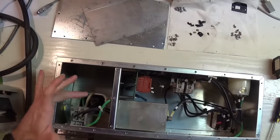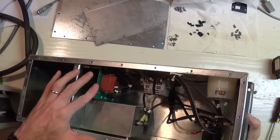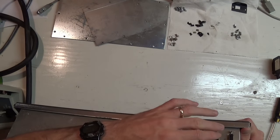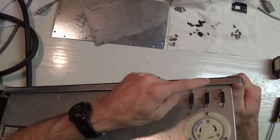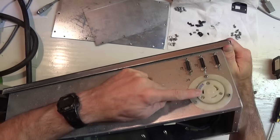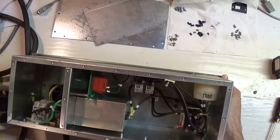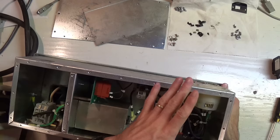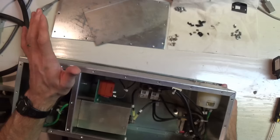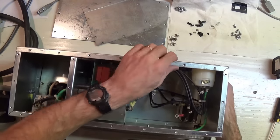The inside is made up of the input bus bar. And then there's a logic board, which I'm assuming is what triggers the remote pop from the controls. The mainframe connects to J2, and then you can use J1 and J3 to reach out and hit the other I/O cabinets so they chain between each other — you can pop all the I/O cabinets at once. And this is the actual outlet to the rest of the rack. I've verified that with the breaker on I get voltage all the way through — at least I get continuity. So for now I'm going to leave it like this and call it good, with the big proviso that it makes me really nervous putting effectively a 50 amp breaker on what's supposed to be a 30 amp breaker outlet. But it should get me going for now.